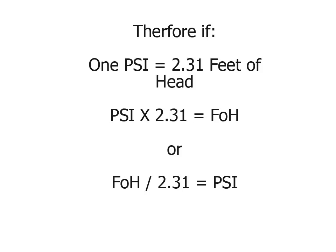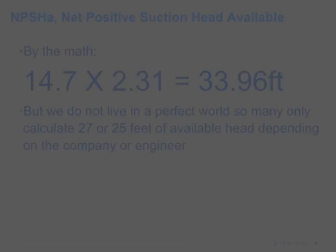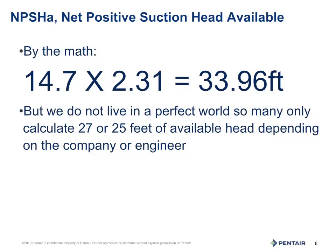This also means if I have a 40-foot pipe, any diameter, and I have 2 feet of that pipe in the water to ensure I don't break vacuum, and I manage to pull a perfectly sealed vacuum at the top, the water would rise 33.96 feet. In a perfect world, 33.96 feet.